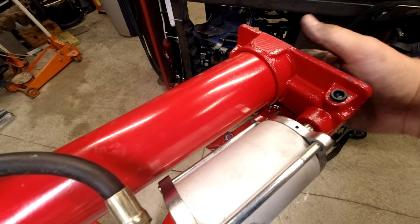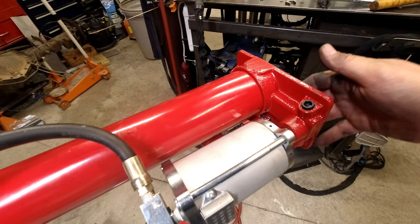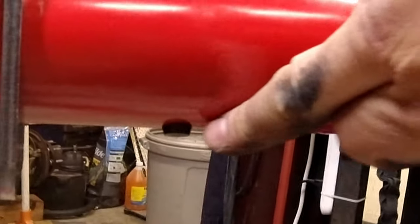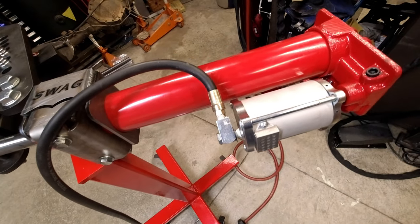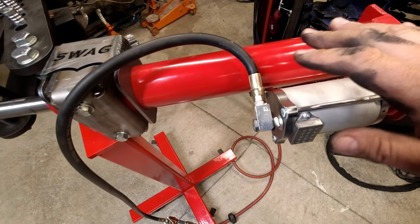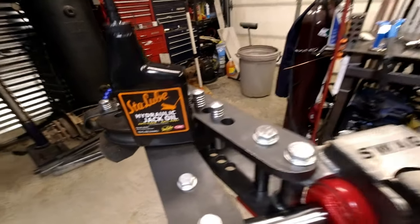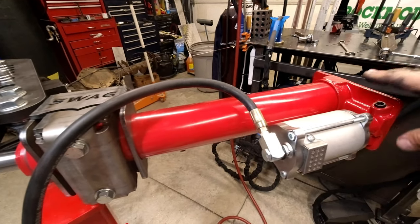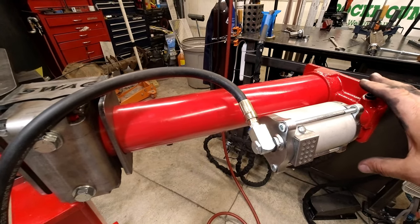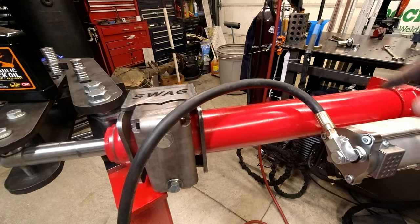When you mount these cylinders they're very touchy about the horizontal — you've got to be horizontal or a little bit past. Typically you've got to roll these under just a little bit so that the oil gets to them. We did add a little more oil: pop out this little plug and get a small bottle of hydraulic oil when you buy your cylinder. These are made to be used vertically, not horizontally, so pick up a little bottle of hydraulic oil, put a little bit in there. If it doesn't work when you put it on, rotate it down just a little bit and you'll find it makes all the difference in the world. But if it's the other way around, guaranteed it will not work.